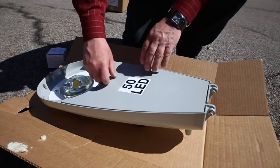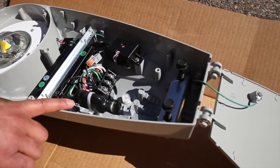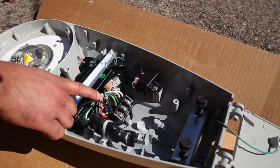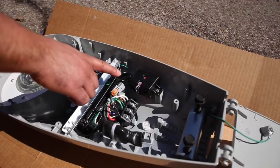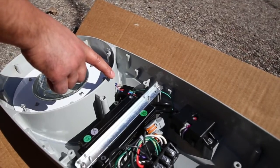Next, loosen the wing screw and open the luminaire. The ATBS features a 10 kilovolt rated surge protection device, a lineman-friendly terminal block, an optional field adjustable output device, and a supplemental transient voltage suppressor.